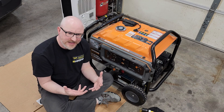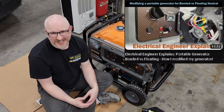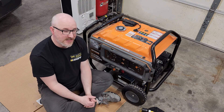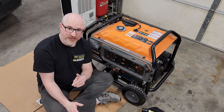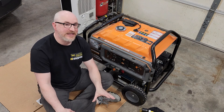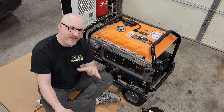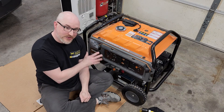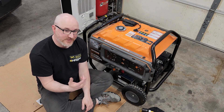So it's a check I have to take — make sure it's bonded. I mentioned in the video I need to add some instructions down here; I just have to decide how I want to print it. Any time the generator is not connected to the house, it stays bonded. When I want to connect it to my house, that's when things get interesting — it goes into a lifted scenario, and the bond needs to be somewhere else: my panel. The way this works is very specific in the order of operation, and I need to print some instructions in case I'm not here and someone else connects it.